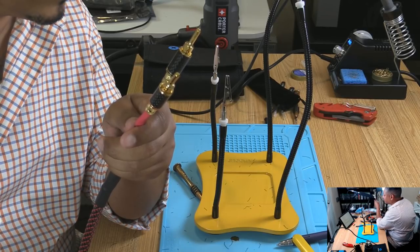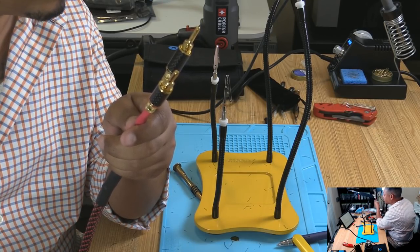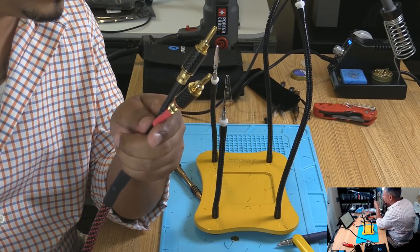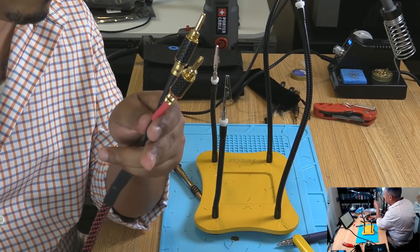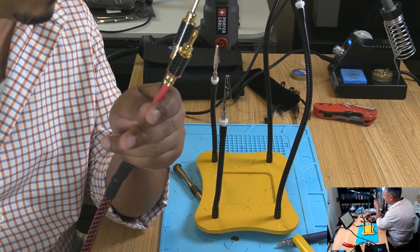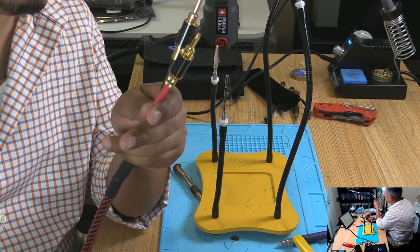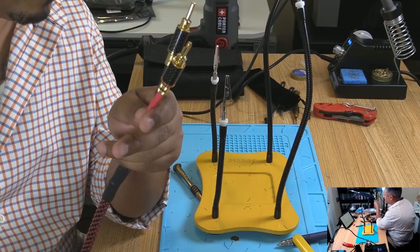The measurement done on the effects of the electrical impedance of a wire versus that of banana plugs shows us that there's more impact on the impedance of a 1 foot long piece of 14 gauge speaker wire, single, not double like these, than a cheap pair of $3 banana plugs from Monoprice.